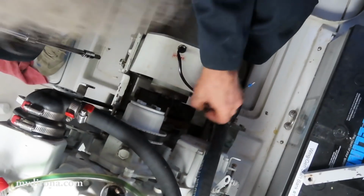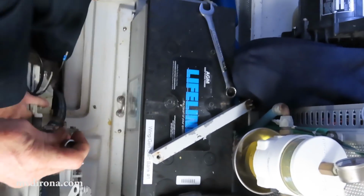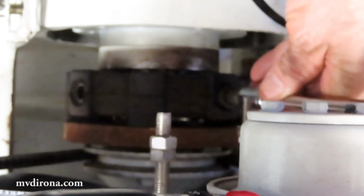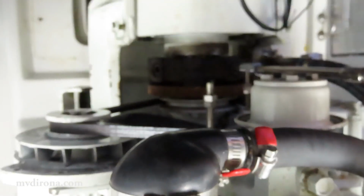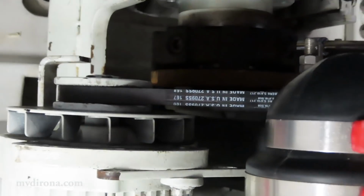You can see the alignment has to be just perfect or it will not go together. You can see the alignment's quite sensitive, where I've just got 2 in there, but 1's snug enough to cause friction, so I can't get alignment on the 3rd. Having seen that, I'll be very careful and put all 4 in, and then get them all settled in place, and then take 1 at a time out for final Loctiting.